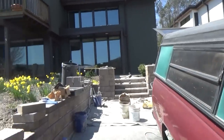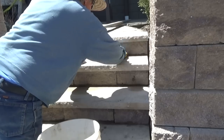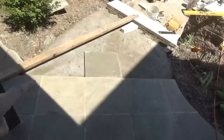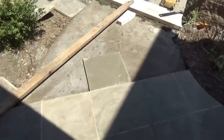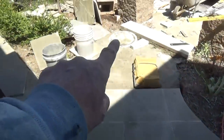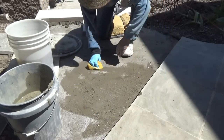We're looking for bad spots from the back here. Now we've got to clean it all up - we've got this all done. We've got this patio going on here and right here it all fell apart because they didn't have no concrete under it. So we came here, put concrete under it. See, they've got sand under here. This part has concrete on it but they used S-mortar. S-mortar don't work in here - you've got to use Portland. So we're going to put all these stones in, following this line. Wet the bottom if you want it to stick.